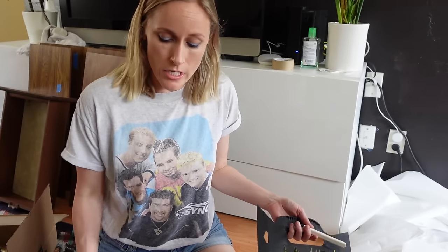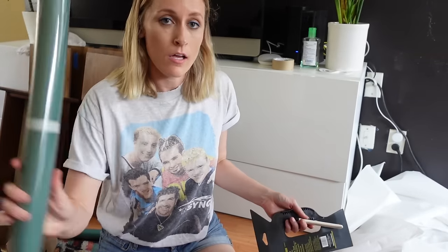If you are someone who has detailed cabinets with cutouts or carvings, there's actually a really genius hack. I'm gonna link it below. I saw it on a YouTube video. Basically, all you do is you get simple little poster board and you cut it to size and you tape it over the front of your wood so that you have a nice flat surface and then you can contact paper over that. To do the contact paper, tools and supplies you need are an X-Acto knife, contact paper.